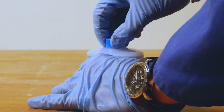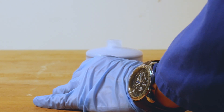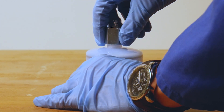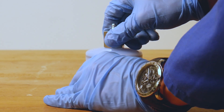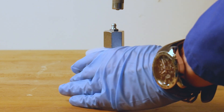You must first install the filling adapter, which can be easily screwed on the top of the empty cartridge. Make sure that the filling adapter is properly tightened to avoid any spillage. After installing the filling adapter you can quickly connect the grease pump to the empty cartridge with a quick coupling.